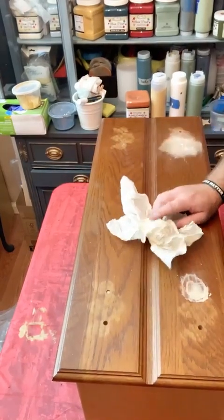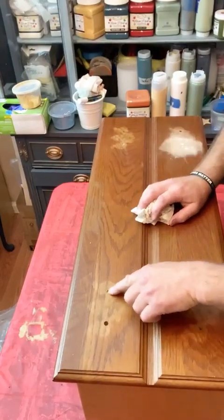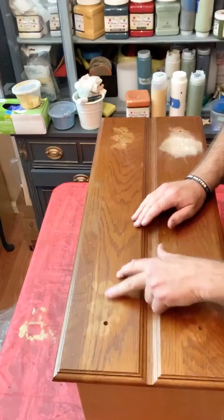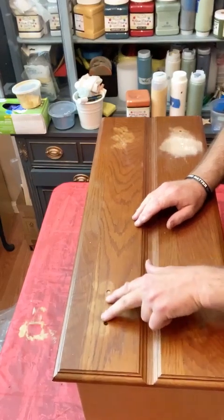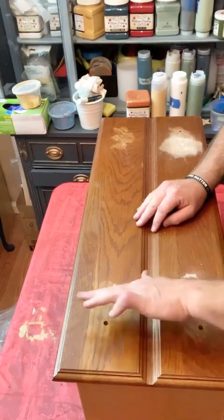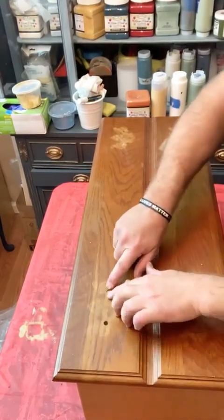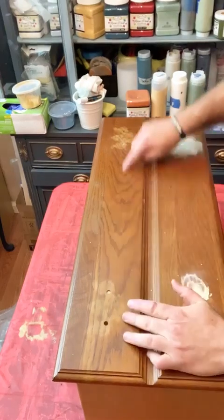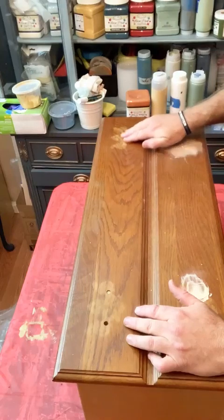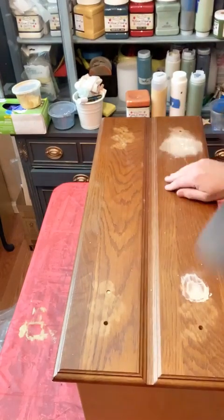What winds up happening is if you don't tap it down below the surface, because it's not a flat edge on the dowel where you cut it, it doesn't feel quite right when you put the wood filler in there. So you wind up sanding down, sanding down, sanding down. All of a sudden, you have a little bit of a concave surface. So if you go down a little bit below the surface, and when you put the wood filler in, which we'll do on the next step, then you can smooth it out nice and flat, and you don't see the little tiny holes. So as we go on to the next step,